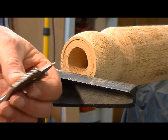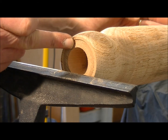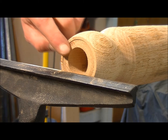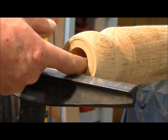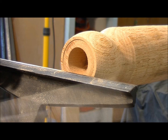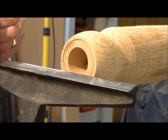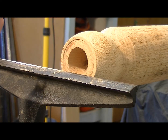Actually, I've got a bit of rust on it now. But because this is 13 and a half inches or so out from the end of the chuck, and this is very, very hard material, I've got as much as I can out with other means other than with gouges, because it gets a little bit hairy, and like I have said in the past, and you've probably seen, things do jump out of the lathe at me. So to prevent that from happening, I've removed as much material as I can like this, so now it lessens the risk. So we shall now carry on.